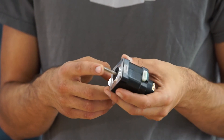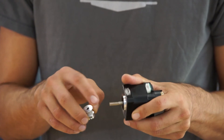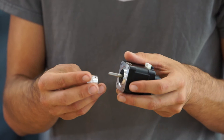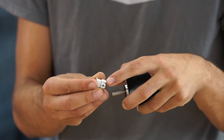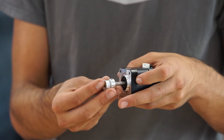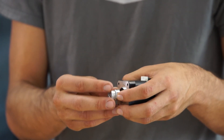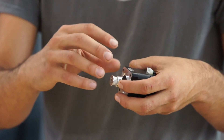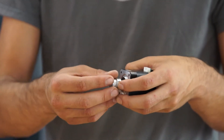The motor shafts on these NEMA 17 motors include two flat sections - this is called a double D motor shaft. The two flat sections provide a nice landing zone for the set screws on the GT2 pulleys. These pulleys slide onto the motor shaft and then you can tighten the two set screws using the 2 millimeter wrench, and then this pulley will be very securely on the shaft. As the shaft rotates the pulley will as well, and there will be no slipping between the two.